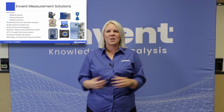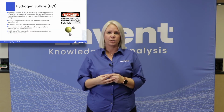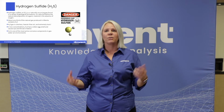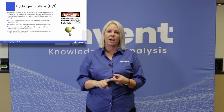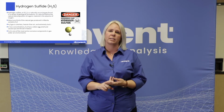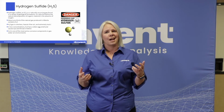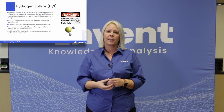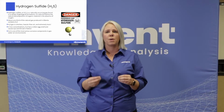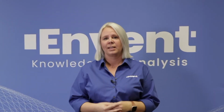So let's get started. We're actually going to be talking about our TFS, which is great for high concentration H2S solutions. H2S, as you know, about 1/3 of our natural gas here in Alberta contains H2S. It's colorless, heavier than air, and extremely toxic. In low concentrations, it smells like rotten egg and causes throat and eye irritation, but in high concentrations can be deadly. H2S is one of the most corrosive components in gas, water, air environments, so we want to make sure that you have none or you can deal with that H2S properly.